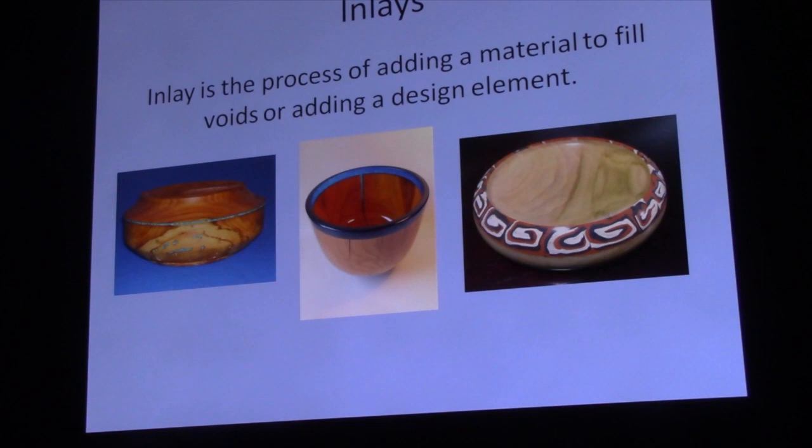With the Milliput, I did those three colors, and you have to mix it for 5 minutes and then an additional minute, each color. So I've taken a whole tube of it, and it comes in a kit like this. And unlike the JB Weld or the Mohawk, it's got its activator built into it. With this product, this is your color, this is the activator. You take off as much as you want or use the whole thing. This happens to be black, and you mix that whole thing for 5 minutes till there's nothing but black.